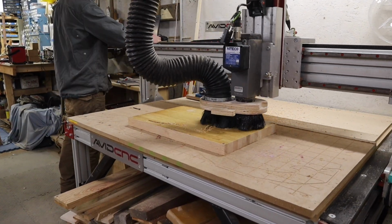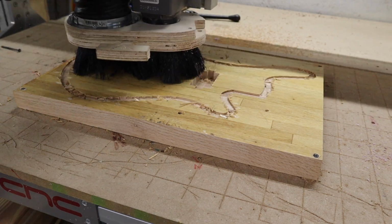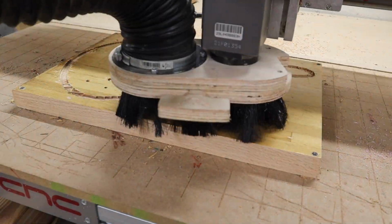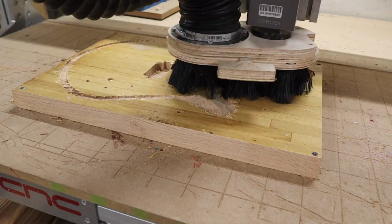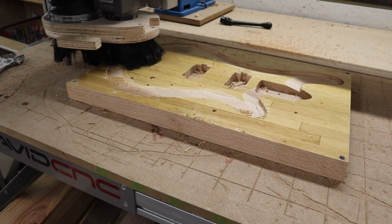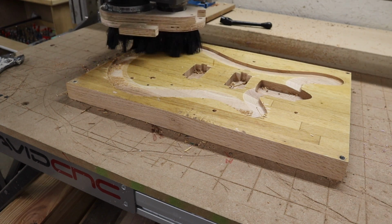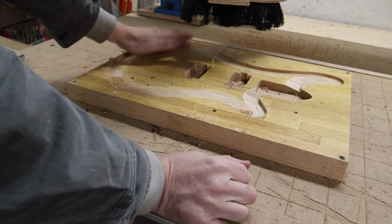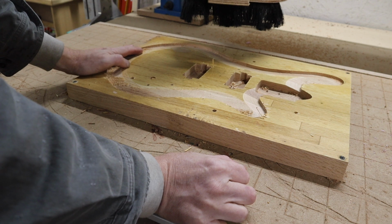Okay, that's enough shameless self-promotion. Now we'll get back to the CNC cutting, and here you can see all of the two-dimensional cuts that I was talking about happening in fast motion, and then I just switched to that ball nose end mill to do the finishing tool passes. And the ball nose will give a smoother sort of surface than that square cut end mill over curves. Nice, so that saved a few minutes doing it that way. Not a ton of time.